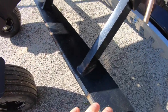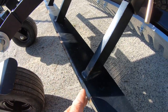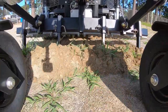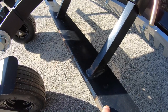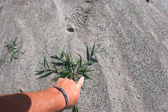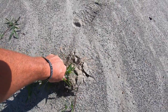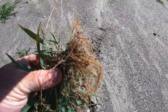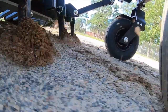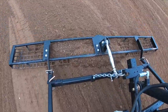This right here is kind of a profile blade and you see it goes straight all the way across. This is one of the original blades — they've got a new set of blades I'll show you later, but for what I'm doing today I think this works best. I'm actually going to use this blade as a weed puller — just barely put it in the ground and let it skim across the top to cut those weeds up and remove the material so I can work the field. I'll use my drag back here to collect it and drag it to a corner of the field.